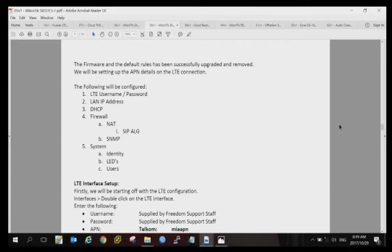So, for example, if the APN is connected, we can see that, but we'll get an alert as soon as the LAN cable on the data side, for example, plugs out of the switch. We'll get an alert to say that the switch on the LTE went down. Okay. So we'll phone you and tell you, okay, the APN is up, but there's no devices connected to it. Then we know it's network related. Okay. And we can also pull graphs to see what is the up and down time of the APNs.